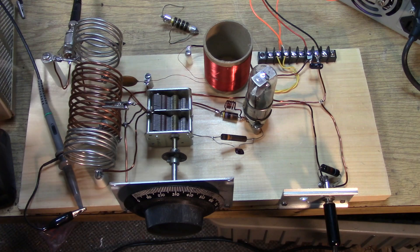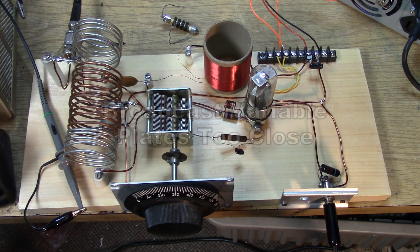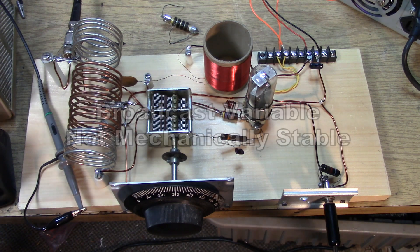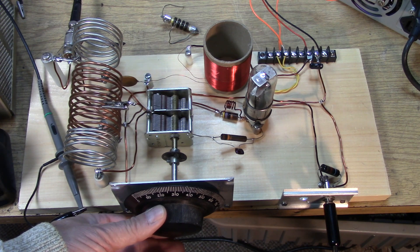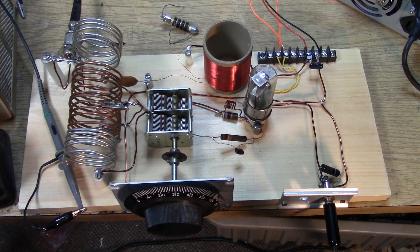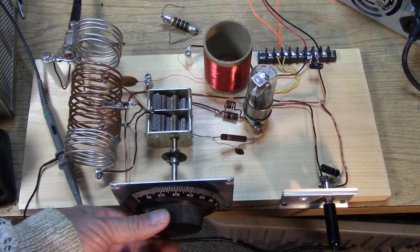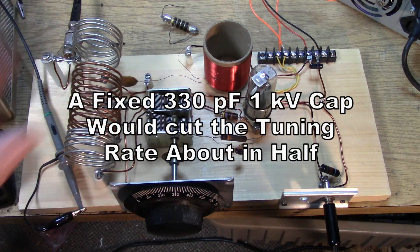The other question is, will this capacitor begin to break down? I was kind of surprised it didn't break down to begin with, but it was fine. How fast does it tune? During the contest you hear a lot of that — there are people that actually do it this way; they don't have a vernier on there, they don't have anything, and that's what you hear — this sweeping back and forth of somebody trying to net you with something like that. So I highly encourage putting a vernier on it, or using a fixed capacitor to make the tuning at least a little bit slower.